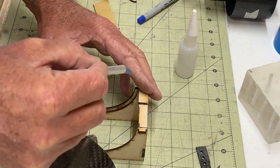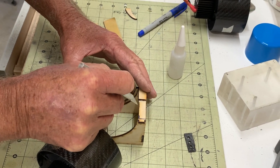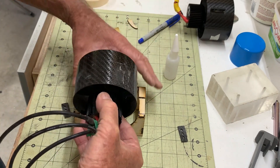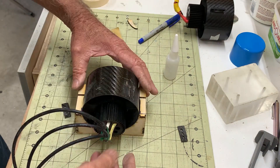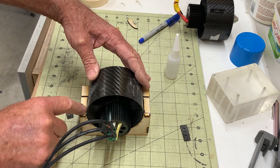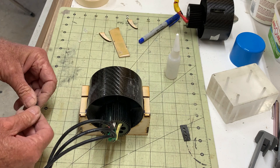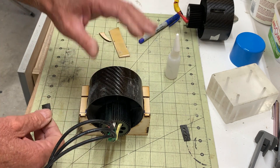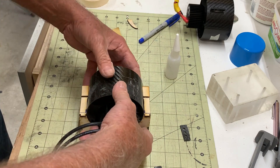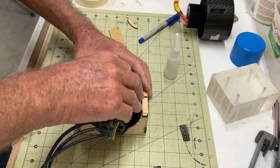I realized that these were so tight — because they were perfectly done in 3D — that the glue would probably drip in and stick. So I've put about a one-millimeter setback on both sides to create a space for the glue. This is so perfectly symmetrical that tape would create friction and I wouldn't be able to sit the fan in, so I've put the fan in, pushed it up to the front stop, and pushed down so it seats in both radiuses.